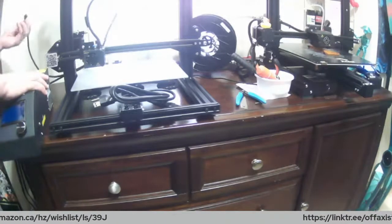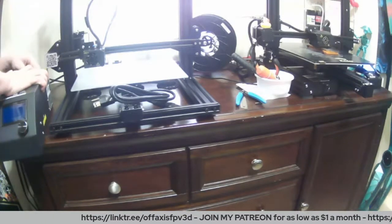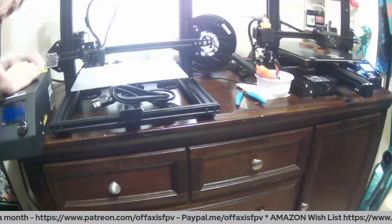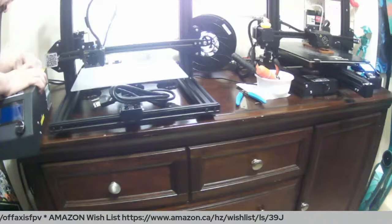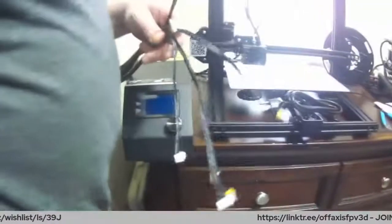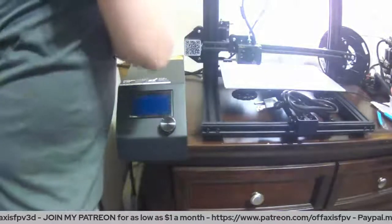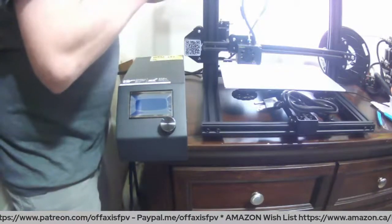So extruder one is the top one because it's 8 pin. Plugs in just like this. Really just plugs in, and then there's a screw to turn on, and that's that. Now we've got the connections for the extruder motors and all the stepper motors and everything. And these are all marked, thank goodness. So let's start with one at a time here. We'll do this one. So this is Z and Z.